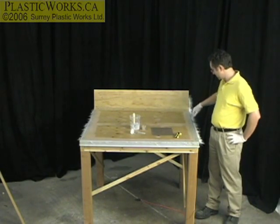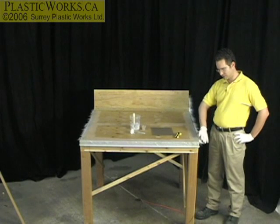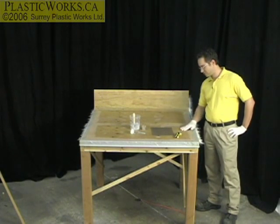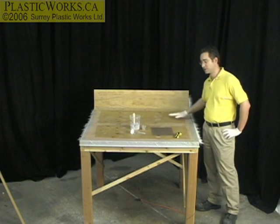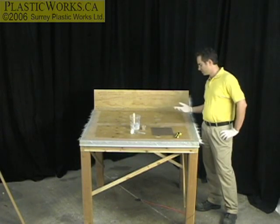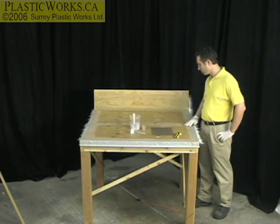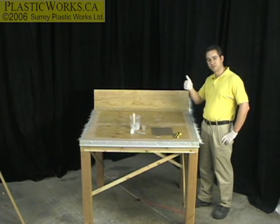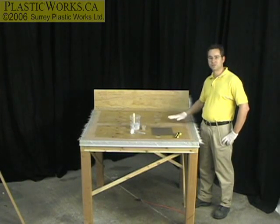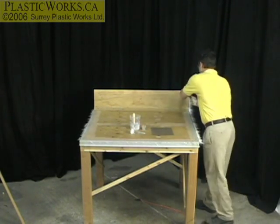What we're going to do is trim off the edge — now's a great time to do it. Then we're going to go over it with sandpaper, sand off the fringe here and blend it into the flushing. We're going to go over the surface, pick up any rough spots. Going over with a gloved hand is actually great because it picks up the rough spots and also protects your hand. The deck here is pretty good, but just a little quick scuffs on anything really sticking up. We'll knock it down, then mix up our gel coat, apply that, and that's our final layer. Then we'll be done.